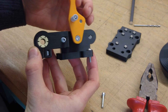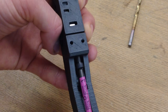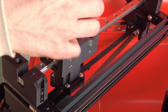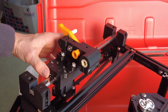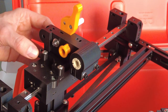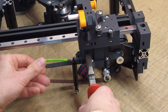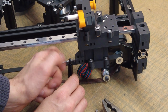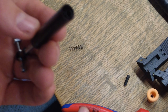The lever arm itself gets a design overhaul too. The shaft is now clamped into the 3D printed part, and some long screws and a better design make this part much less flexible. Now everything can be installed back onto the carriage system — with the new design the unit can be adjusted precisely in one dimension only. After some tests I noticed that the oil pressure cylinder slow-lowering device sometimes gets stuck after not being used, so I inserted a small spring to give it a little kick just on the first few millimeters of movement.